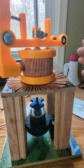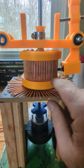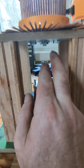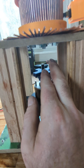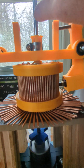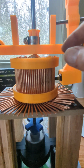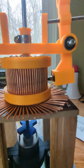It's going to rotate like that with two brushes, negative and positive. The slip rings are going to have to go down here to put power. Actually, they can't go there, can they? The slip rings have to go up here. So the slip rings are going to have to go up here, which is going to be a pain because I'm going to have to print something that brings the brushes all the way up to here for these slip rings.